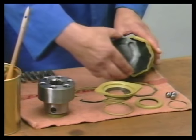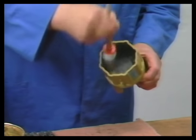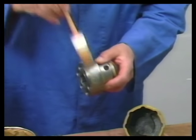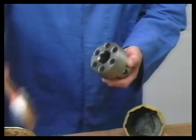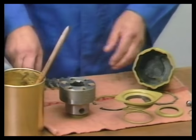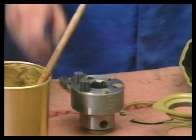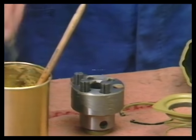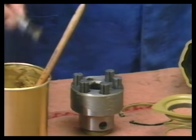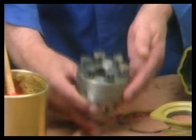Assembly begins by inserting the driving plate into the housing. Note direction of rotation of driving plate. Grease driving plate inside of housing and hub with a multi-purpose grease. The six plungers provided with pressure springs are lightly greased in the region of the spring and inserted into the hub bores provided for this purpose. Grease plunger heads, insert hub into housing, and clamp into vise.